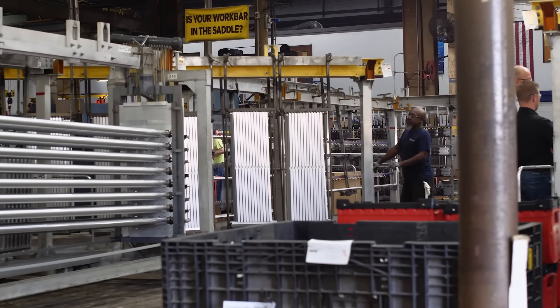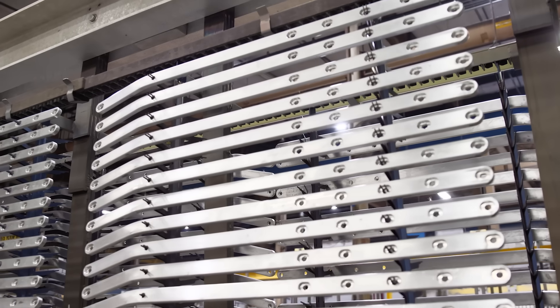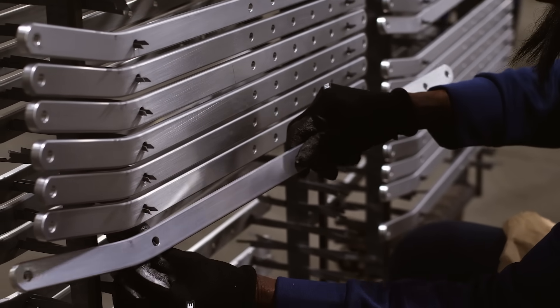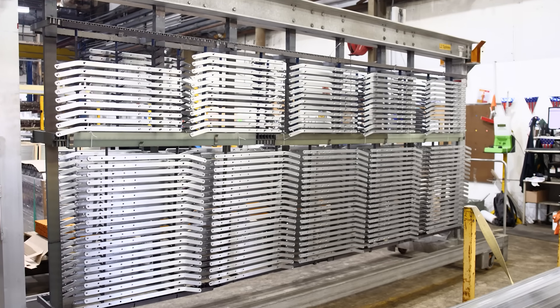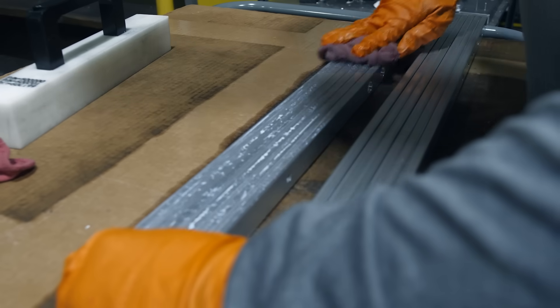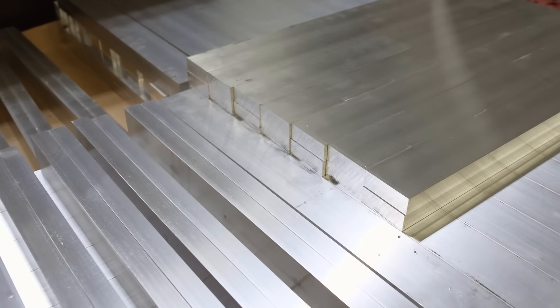Off-site, most of the parts of the rack are anodized to increase wear and corrosion resistance. This process also achieves the final color, either silver or black. The aluminum parts are placed on aluminum or titanium racks, which hold the parts firmly during the numerous tank immersion steps while providing an electrical conduit to the part. The process begins with cleaning, descaling, and etching to remove contaminants and prepare the surface for a consistent, uniform aluminum oxide layer to form.